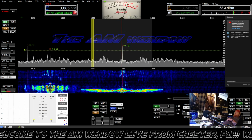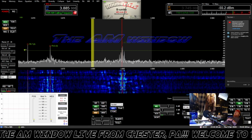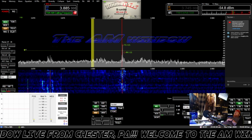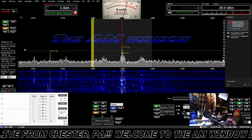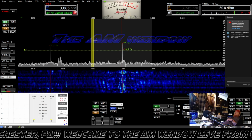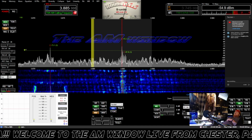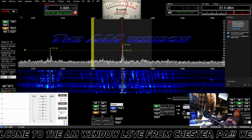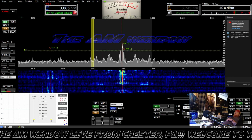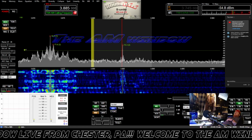Well, the Ranger circuit is set to match the impedance of the RF load of the 6146. The 2E26 is half of the 6146 in terms of emission. So you put a 2E26 in there, and that tube wants to be optimized around 50 to 60 mils. It's overcoupled. So the only way and the proper way to reduce the power of any transmitter is to reduce the plate voltage on the modulator and the final.